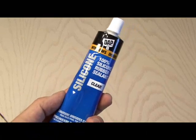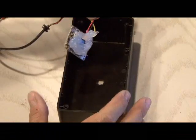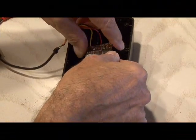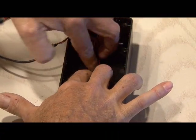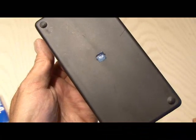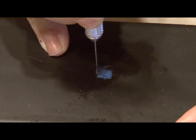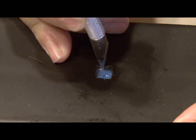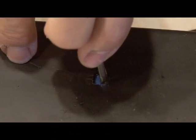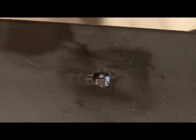Taking some ordinary silicone sealant, we want to completely cover the imager board in silicone. Then take the board and line it up with the square hole you made and glue it to the bottom of the project box. You can clear away any silicone to get a better view, but make sure it's lined up with the blue square tape you put on earlier. Then you're going to have to wait about 24 hours, take your hobby knife, and start cutting away carefully at the silicone to reveal just the blue tape, which you'll remove — and if all went well, a perfectly clean imager glass.